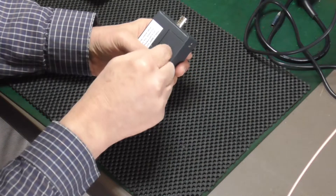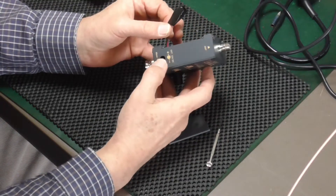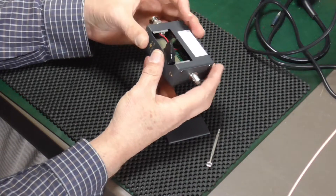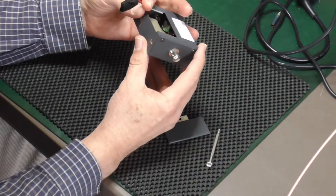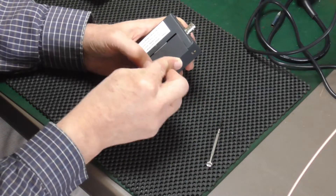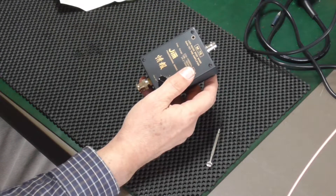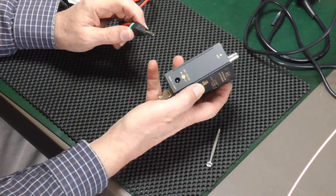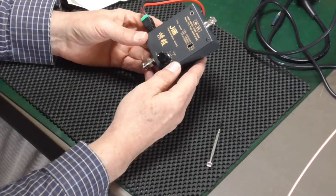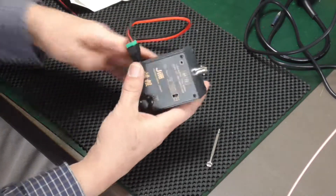I can open this up using a little screwdriver to get it started. That's where you put your battery. If you're going to attach it to an external source, they say to tape the battery contacts because there's metal inside that can short to the contacts. That's the inside — it's pretty simple. It's designed for indoor use only, not ideal for mounting at an antenna. I've got a power supply here at 12 volts, current limited to 100 milliamps, plus on the inner connector.